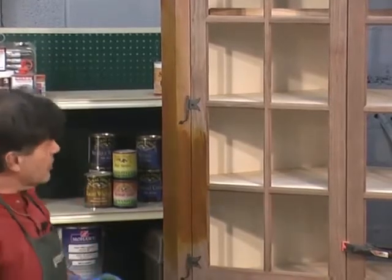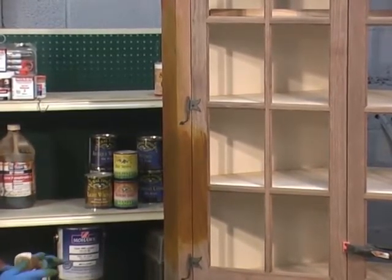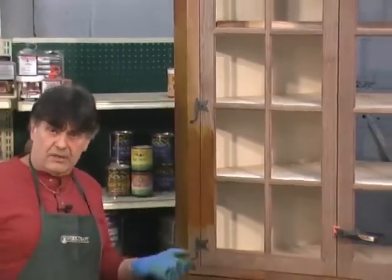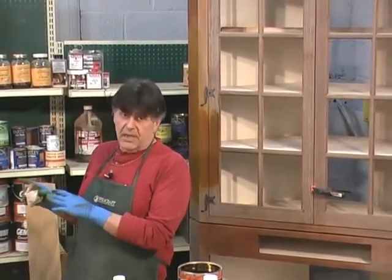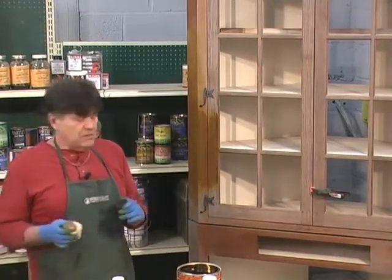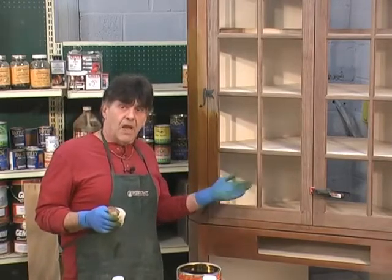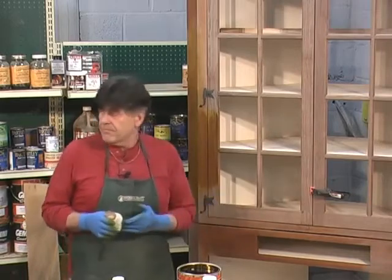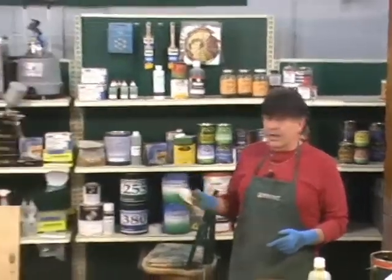But I'm going to dye this with kind of a light toned brown dye. Now you got to understand something about walnut. Walnut, as it ages, it lightens. Mahogany, as it ages, like cherry, darkens. Simple enough. Here's a little rule of thumb. Any wood with the word nut in it lightens as it ages. Chestnut, butternut, walnut. Any of your redwoods, redwood, cherry, mahogany, darken.